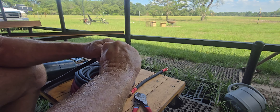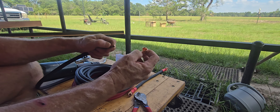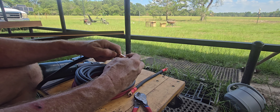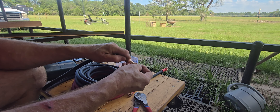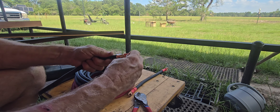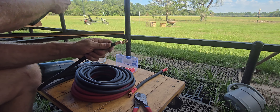You kind of want to bunch these up. One good thing about these crimps that I have — I've had other ones — is that this has basically that tapered end where it's kind of fluted out. And that makes it real easy to get all these wires in there. Because when you have one that's not like that, you can spend a lot of time trying to get all those wires strung in there.